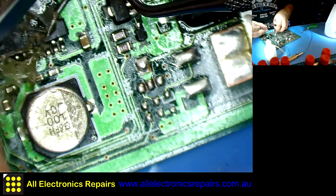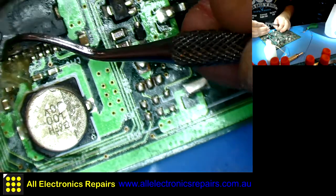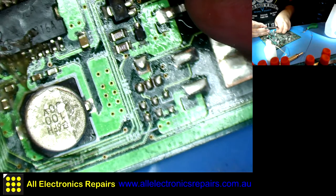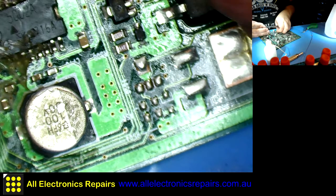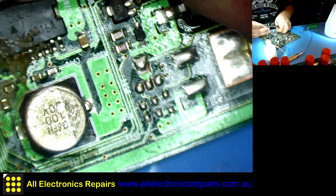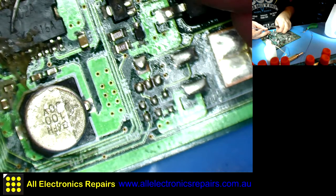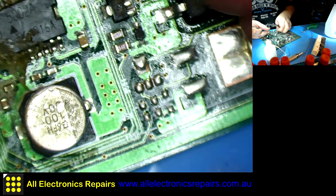They were screwed in. I don't know. I don't think they were. How do you screw and then what? File them out? No, that doesn't make any sense. I think that they were just embedded hot in the plastic, and then by machine they were simply riveted. So they are just rivets embedded in the plastic in a mold, and then while assembled, they were simply knocked on the head to flatten out. You have to look at how they're manufactured. They wouldn't take the time, because these things are mass produced, aren't they? Oh, absolutely.